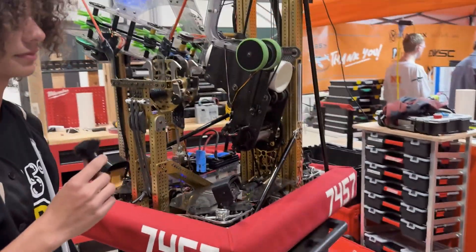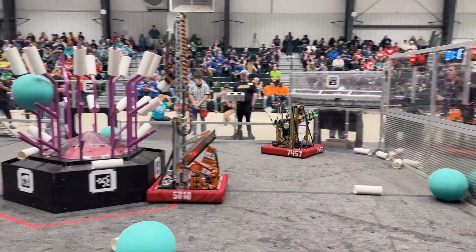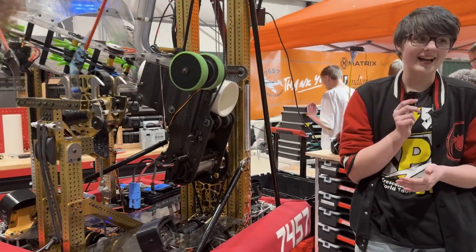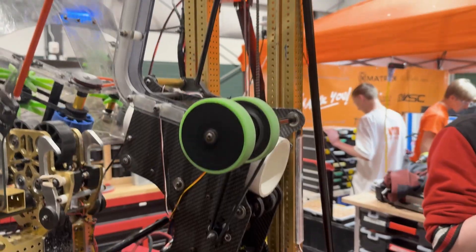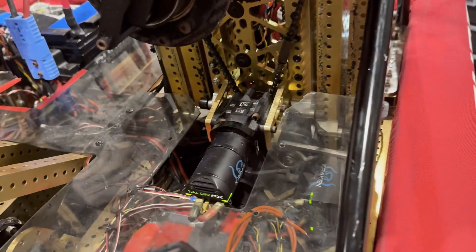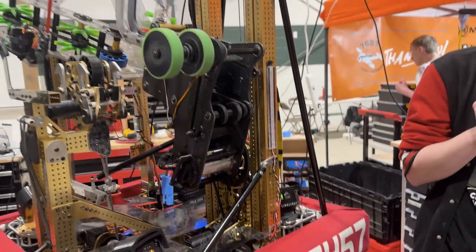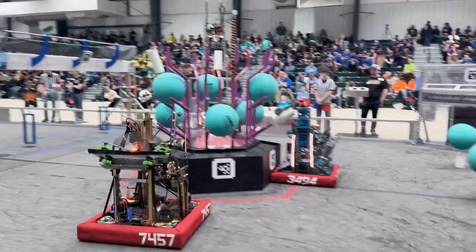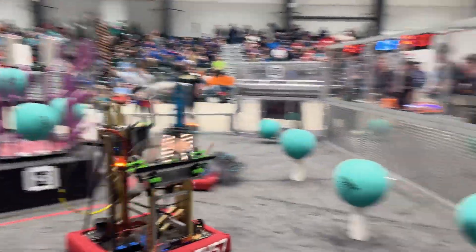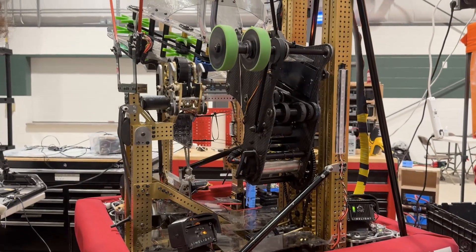The whole journey of the coral through the robot looks really interesting. How do you determine your setpoints with your elevator and how you move throughout the reef? A lot of our design process is a mix between CAD and testing. We have all of this very well done in CAD — down to the tube punches, everything can move and sync. We also take into account what programming can do, making sure programming has dead zones where collisions can never happen. A lot of PID tuning. When it comes to knowing where we are on the reef and on the field, we use a mix of odometry and vision. We also have redundancy there: if our vision reading is over a certain degree off from what our odometry says, it disregards that specific reading so a funky vision reading won't mess up our robot.